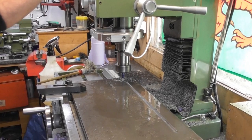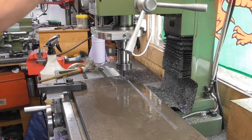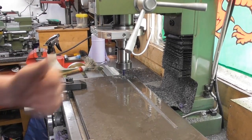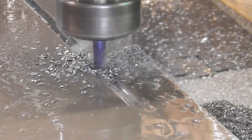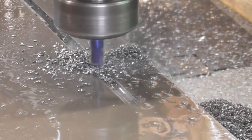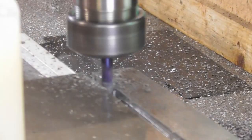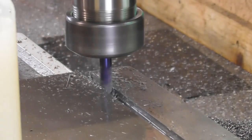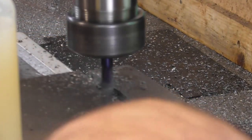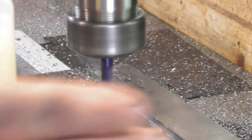It does stop chattering but I'm pushing it a bit here. So two cuts then step over. I've stepped over now to 0.5mm to my finish size, and that'll leave this section of the plate at finish size, ready for me to move on and do the next cut.